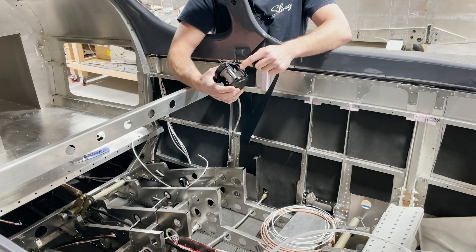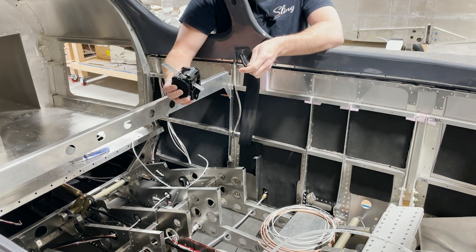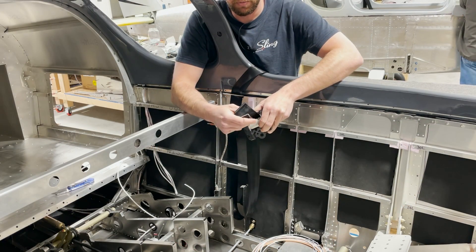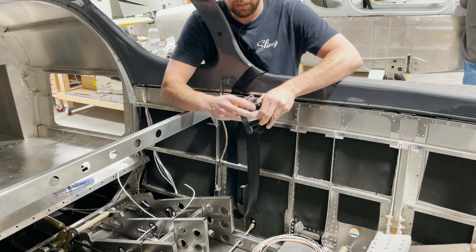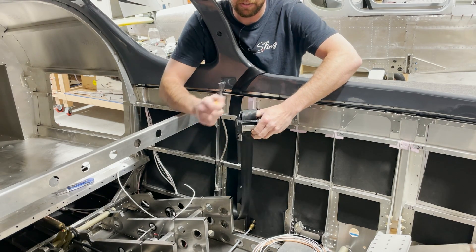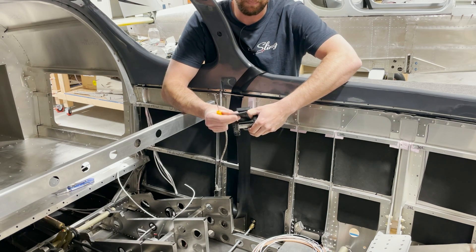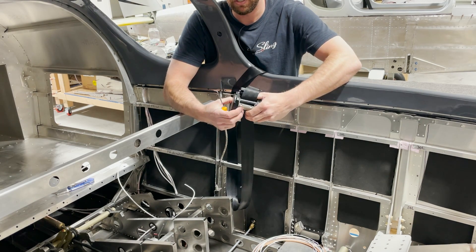Run it down through this piece, down around and in, then reinsert the pin. To confirm you're doing it properly, note that on one side there is a deeper, wider groove than on the other side — that wider groove is for the plastic pin. So if there's any question on which way it came out, just make sure the plastic pin is on the wider groove section.